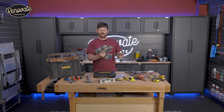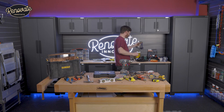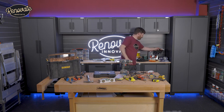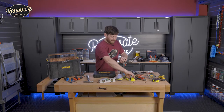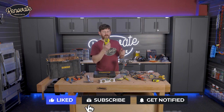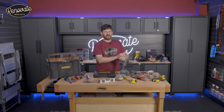When using it above your head, make sure to wear protective glasses — debris will be flying off. The toolbox is getting more and more full now. Eye protection is very important; it's really important to get your PPE — gloves, safety working gloves, goggles, ear defenders. On a safety note, when you are drilling into walls it's good to check the walls first. Here I've got a stud detector — it finds studs on a plasterboard wall and also checks for voltage hidden in that wall. If you buy one, read the instructions, understand them, know how to use it, and test it to make sure you're confident it's working correctly. Then you should be fine to use it on your own project.